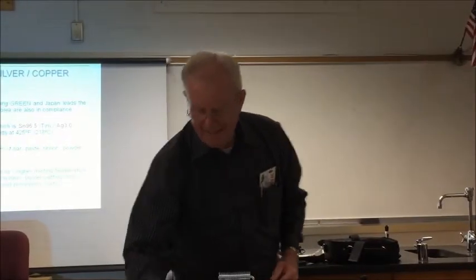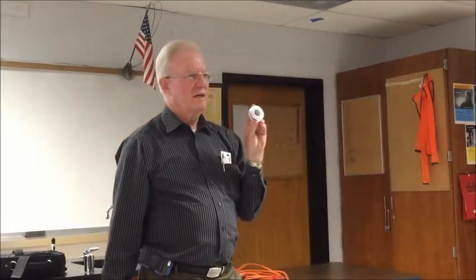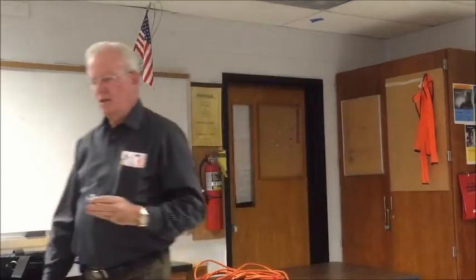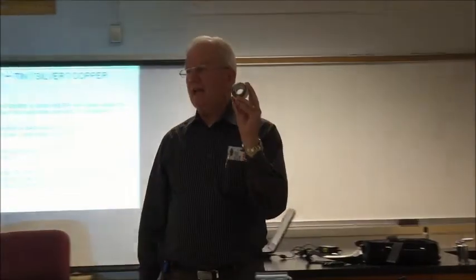It is not eutectic. Now guys, I always go overboard on things. I'm using 62% tin, 36% lead, 2% silver. So I use silver-bearing solder. I work for a satellite company that I build all their coax cables for. And we launch about twice a year over here in Fairfax City. Everything that I solder on board that aircraft going up in space, I use silver solder. Does anybody use this? Occasionally. Nice. And guess what? For Tektronix scopes, all over it. There you go. This melts at 361. The silver solder melts at 358.